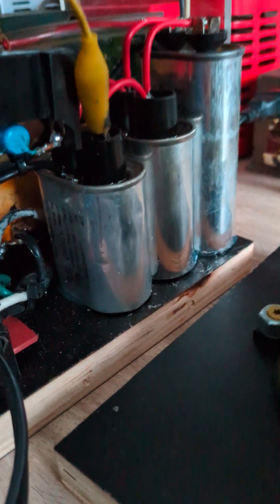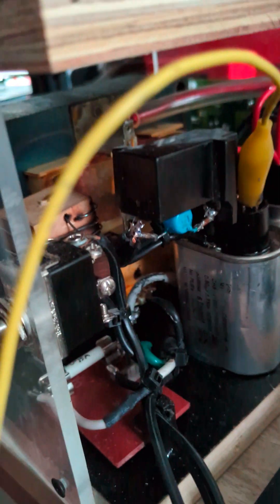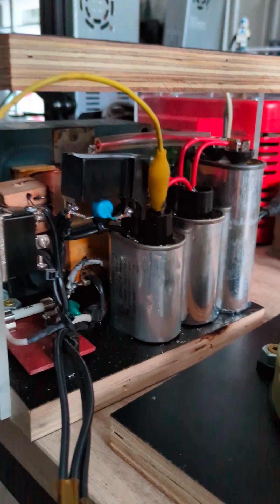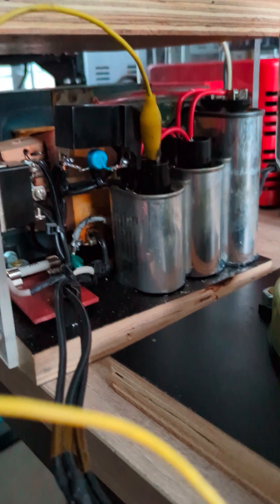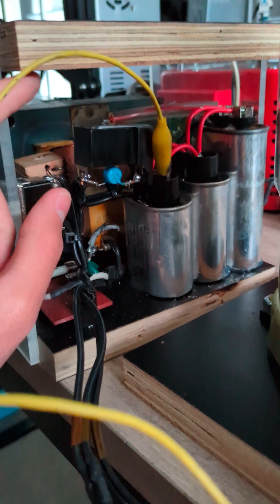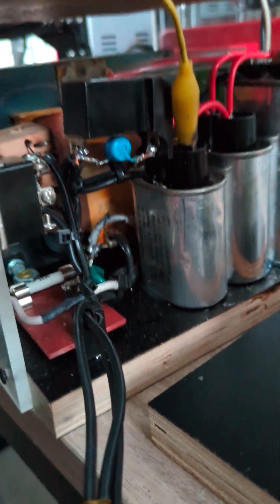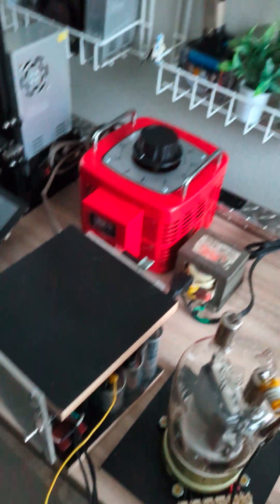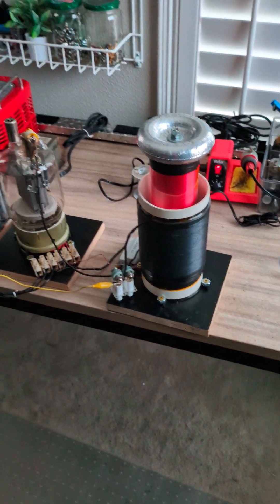The microwave oven transformer powers the voltage doubler here, and it has about three microfarads of capacitance. This is the microwave diode along with the one nanofarad bypass capacitor. In most setups people chain together a bunch of smaller diodes, but I really don't see the difference between using this diode or a bunch of other diodes — it hasn't really affected performance either way. So I'm just using a regular microwave diode because it's easier. This little blue thing is just a bypass capacitor so that all the high frequency power does not go back into your supply and into your house power. If you want the schematic for this, stick around — I'm going to be showing you the schematic at the end of the video.